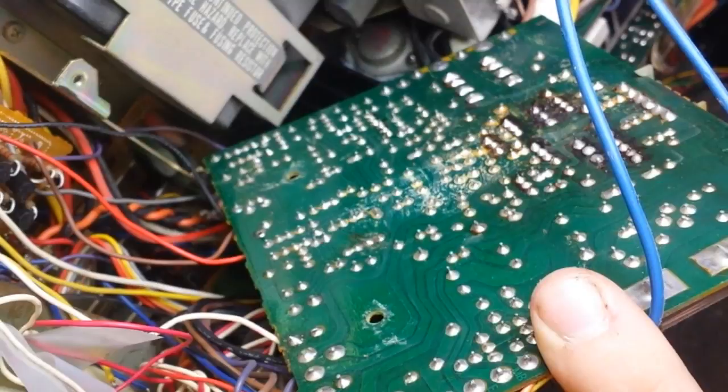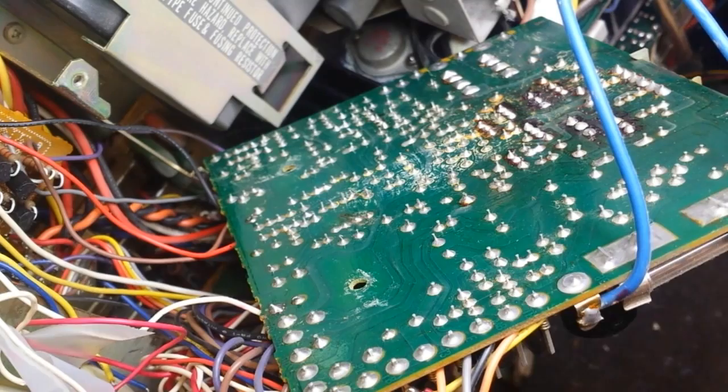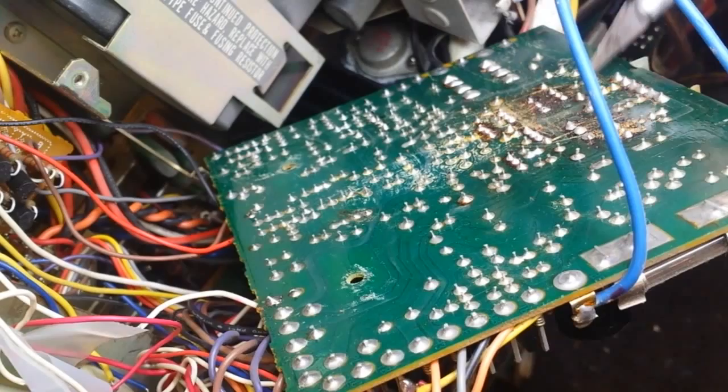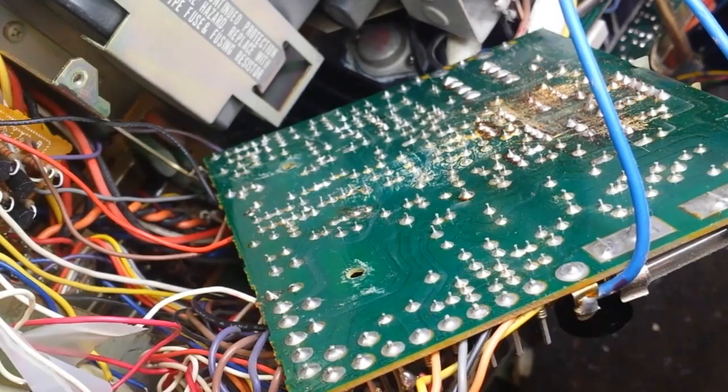This is the underside of a 2020, and there's evidence that somebody has resoldered this board — lots of flux here, cheap solder, but it looks like it isn't crystallized so it was probably done with a high-temperature gun. With this much flux involved, I usually recommend you scrape all this away — in some cases it will attract solder bridges which can wreak havoc.